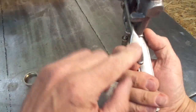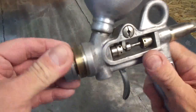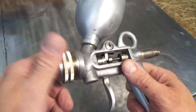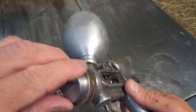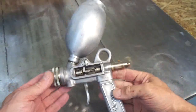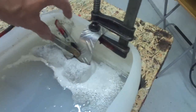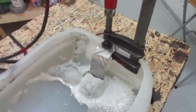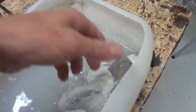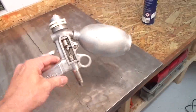Shiny and new — I think this one is stainless steel here. It was definitely worth the effort. So if you are considering doing this on aluminium, it works, as you can see here. Now let's have a look at the sacrificial anode. There is your dirt — it collected all the gunk from the cleaning process. Electrolysis cleaning on aluminium: I never did this before, but you see it works.